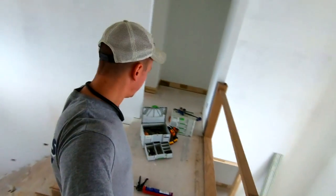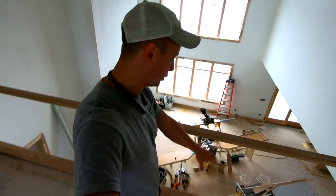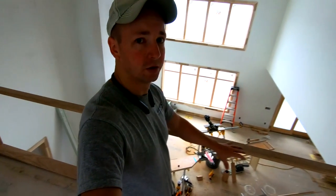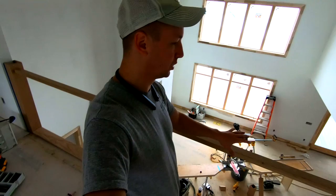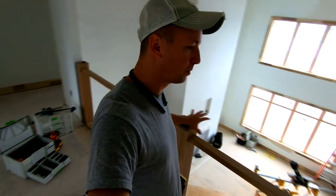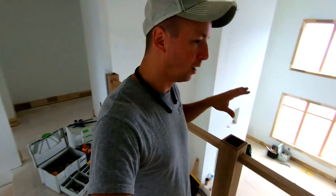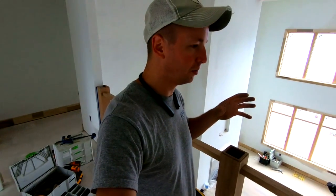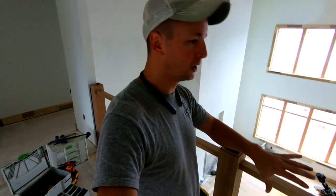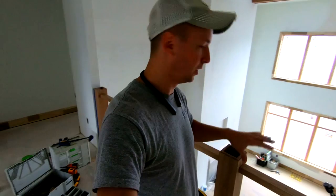So we're up here at the balcony, and as you can see, I've got my handrail and shoerail in place — those are not nailed off or installed, they're just dry-fit. I dry-fit them because it helps square up the newels. Whenever I set the newels in PL, it helps keep them where they're supposed to be while they set up. I actually did this yesterday afternoon, so everything should be pretty locked in this morning.